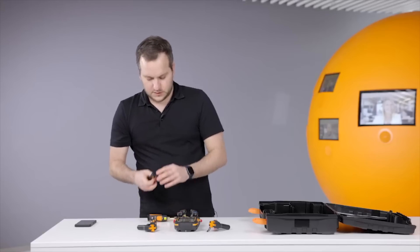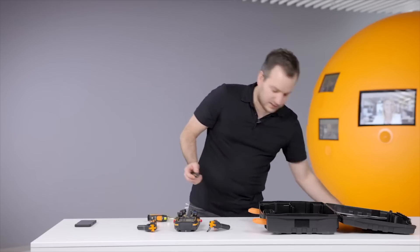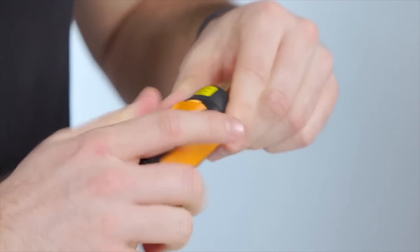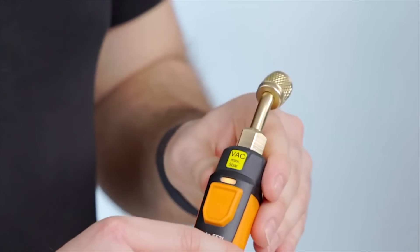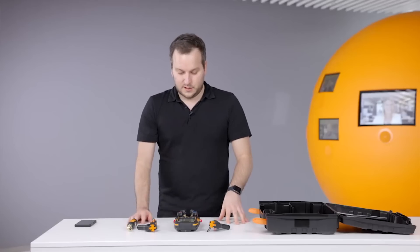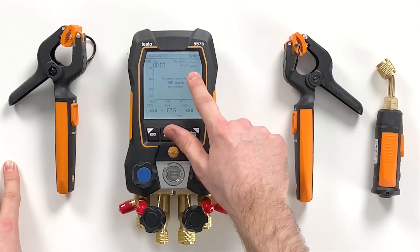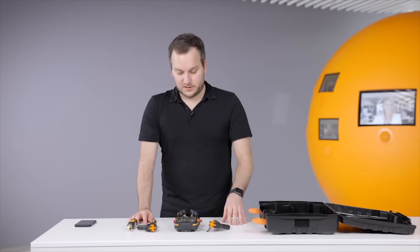Take away the strap — for this we have to open the battery compartment, bring it back in again, and then we can see how directly this probe starts to power on and starts to connect. Now it's green, it's connected. We can see it also here on the screen — the 552i is connected, reading microns — and we would now be ready to do the vacuum measurement.